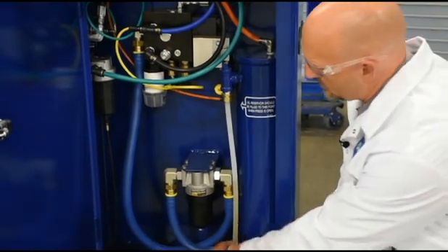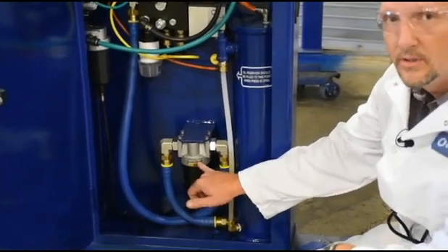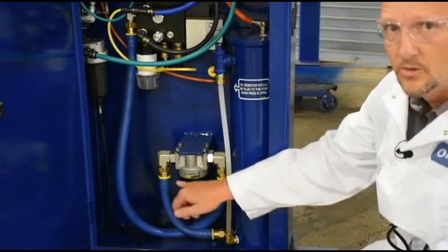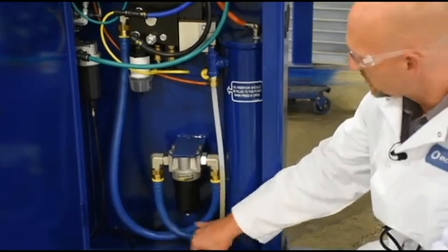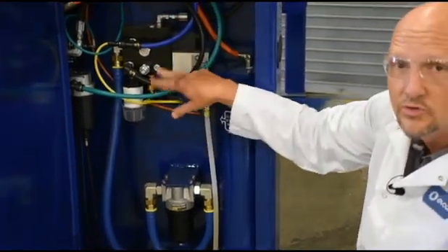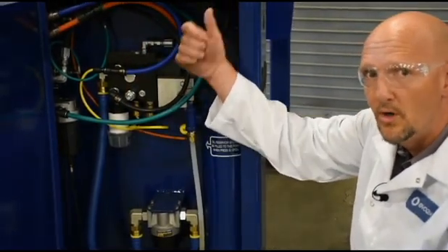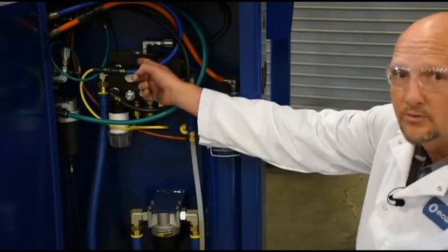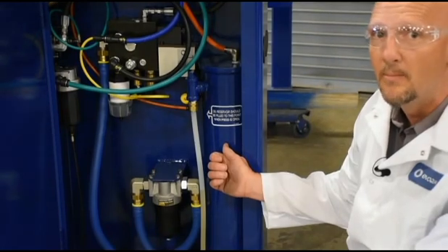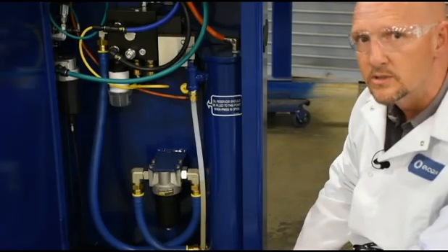Your oil comes through this hose through your filter. This is your hydraulic filter right here. This filter is a little bit special in that it filters as it goes through this way and also as it goes back the other way. You're going to push your oil back up through the manifold block — this is where you have some control valves and your relief valve into the cylinder. It pushes the cylinder closed. When it opens, all that oil comes back through the manifold, back through this hose, back through the filter, and fills your reservoir back up. That's basically the components we have there.